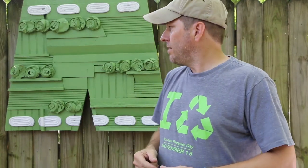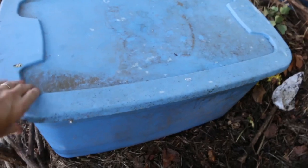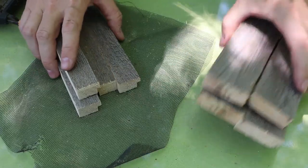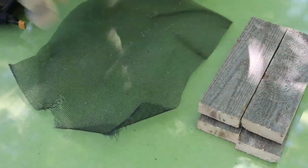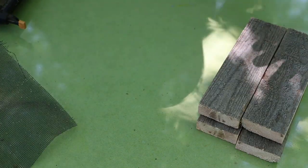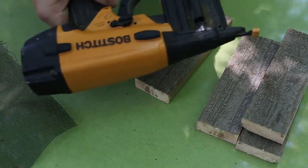So that's an option too, meaning you wouldn't have to do this step in the project. There's a soldier fly right there — I've got a soldier fly bin over here, so they're nearby. For our lid, we're going to use our 2-inch pieces, 1-inch pieces, and our screen. If you're going to do this with a hammer and nails, use finish nails so you don't split the edges of the wood. I'm going to cheat and use my nail gun.